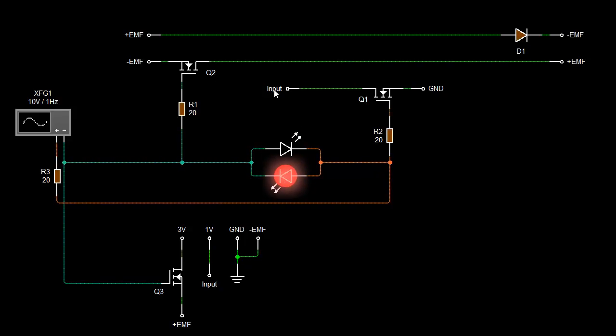You have to adjust your duty cycle on your input coil to get all this to happen — it's not just simple, bang bang, go. There is a bit of playing around. You might have to add turns, fiddle around for a while. It might not work the first time, but you'll know once it's working. The timing of this circuit is fairly critical. What we're doing is switching the input coil off shorter in time — a shorter duty cycle. So we're pushing the magnetic field into the core, getting the terminal voltages up as high as we can, within reason. We don't want to go too high — it gets too dangerous, risky, can damage equipment and yourself.